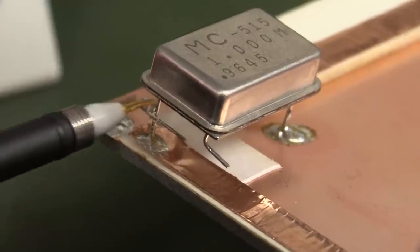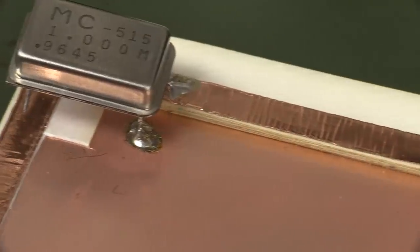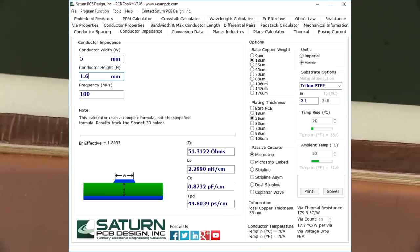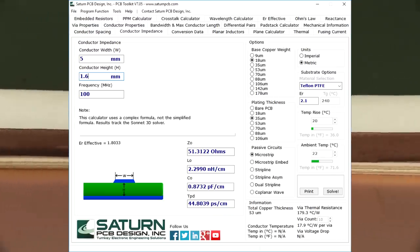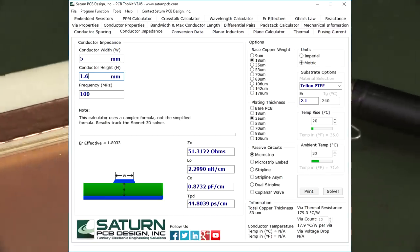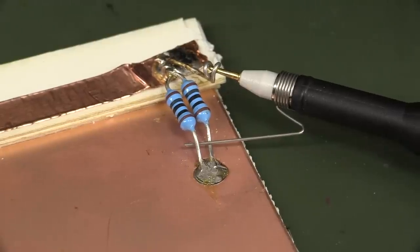The output goes along this copper tape which is 5mm wide and about 1.6mm thickness — standard PCB — giving roughly 50 ohms impedance, terminated into 100 ohm resistors in parallel, so terminated in 50 ohms. We have the same low-inductance probing solution at the output as well.